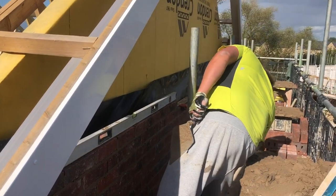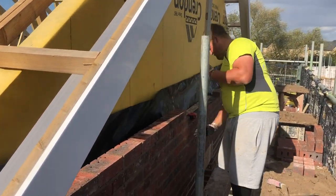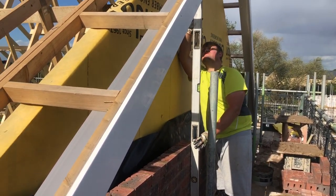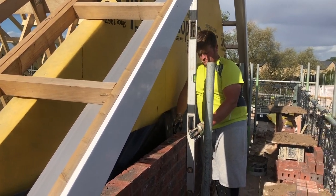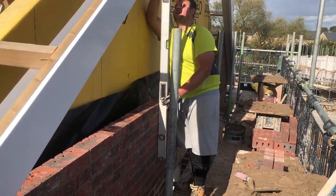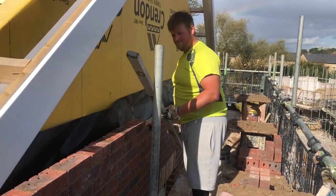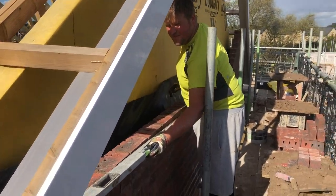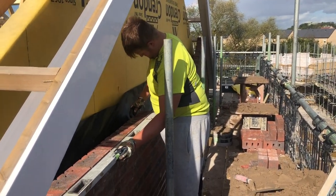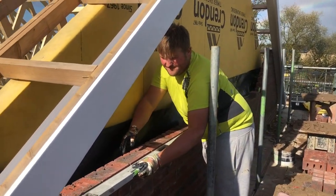Basically, another subbie firm had been on the site before the firm I worked for came on, so we ended up taking over a load of houses not built by our subbie. We got paid to clean the bottom radon tray, which was absolutely packed — think of it building up to floor joists without anyone cleaning the cavities. Hessian in the cavities, glued together with two layers of gobbo — we were pulling out 150mm thick sausages, 125 wide, sometimes a block thick. That's why it took me and the old man at least a day to clean out, so that's what I meant by cleaning cavities.